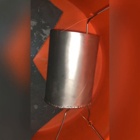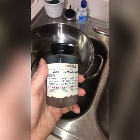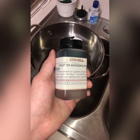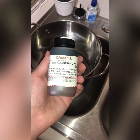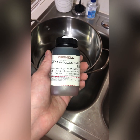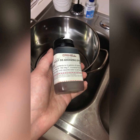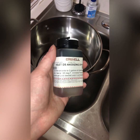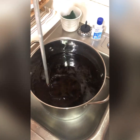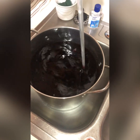You can really see the bubbles starting to form — that's a good indicator it's working correctly. Since you have two hours to kill while the part's in the anodizing bath, you can go ahead and mix up your dye. I buy mine from Caswell Plating; this is Violet DS, and it says to add the entire bottle contents to two gallons of distilled water and then heat it to 140 degrees Fahrenheit. I use stainless containers from Kroger — about 15 bucks apiece — and I have one for every color so I can reuse them. Give the container a good mixing after you pour it in, then put it on the stove and get it warmed up to 140 degrees, so when the part comes out of the anodizing bath you can just drop it in.